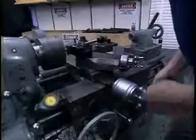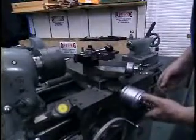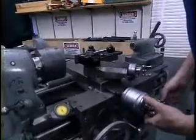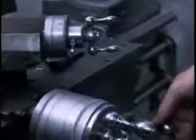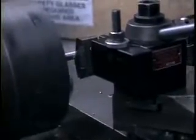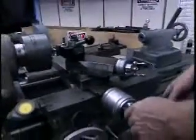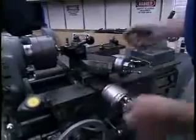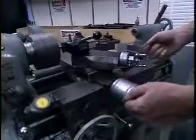So now we've completed another pass. Back things out, back it away from the part, bring it again up against the feed stop, dial in another 5/1000ths, and again wait for the number to come around. Engage the feed. Stop. Very easy. Pass after pass, it's easy to lose track of what to do next.